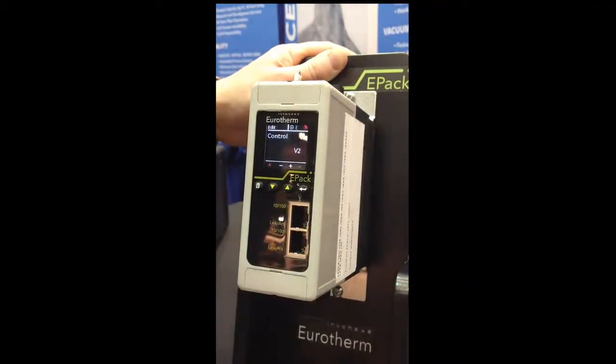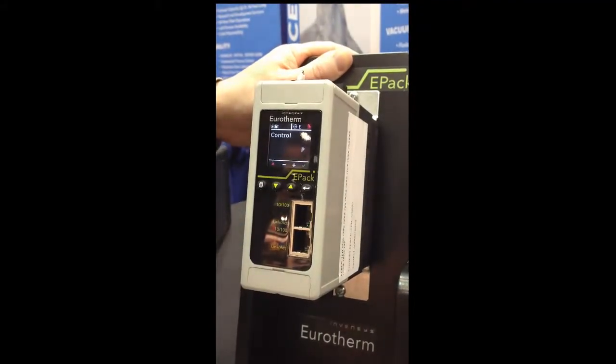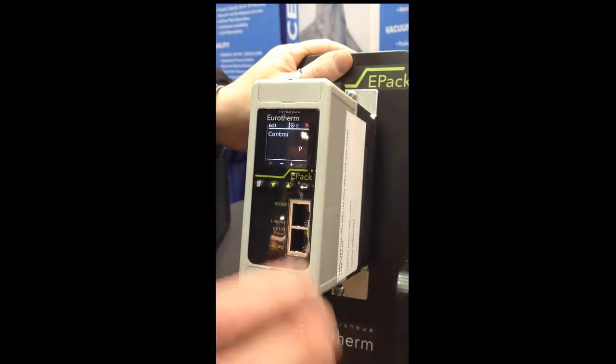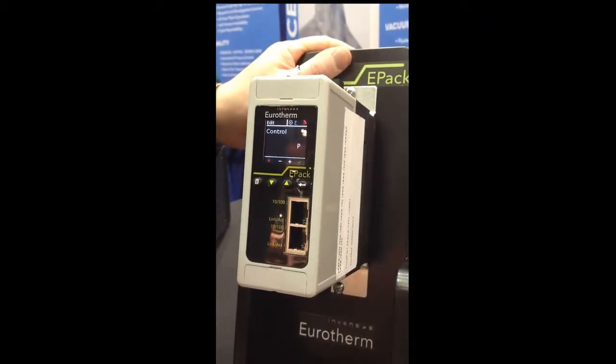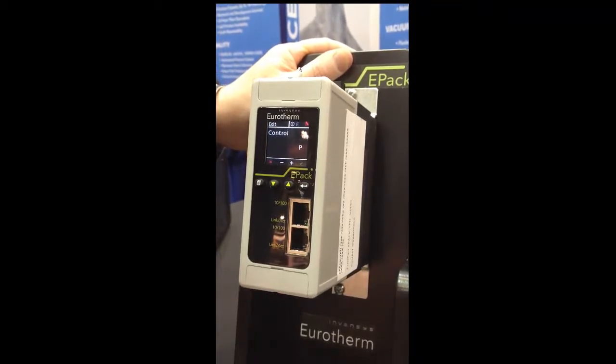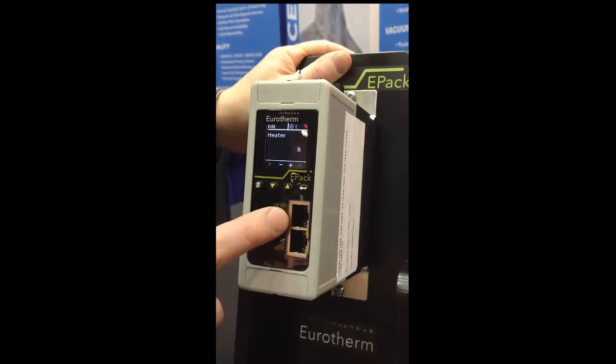I can have two different kinds of control mode. Voltage squared is pretty typical, and in some applications I also have the ability to control the kilowatt or power directly with that device. So that device has an internal control loop inside, and I will actually be able to monitor the power. So let's do power control.